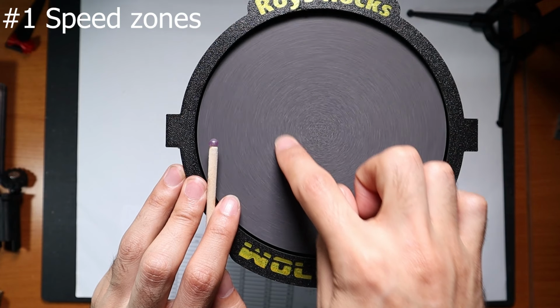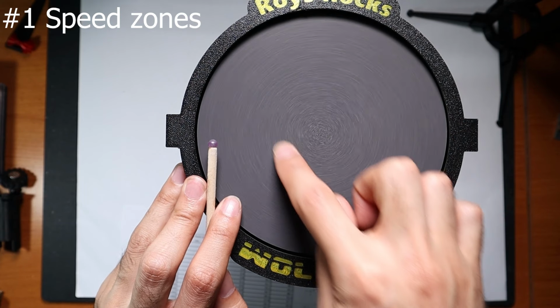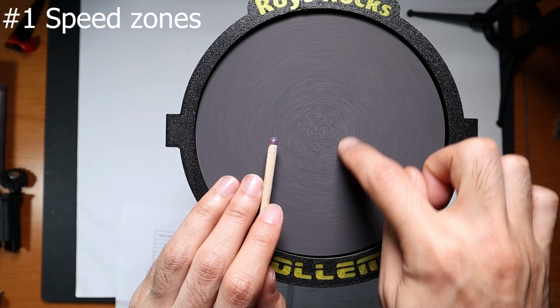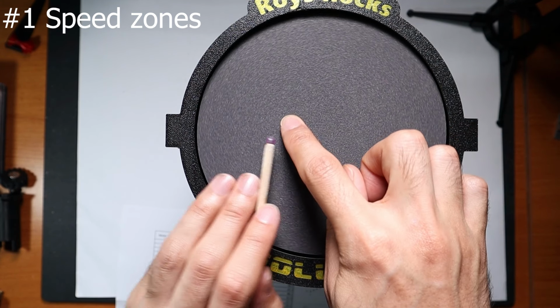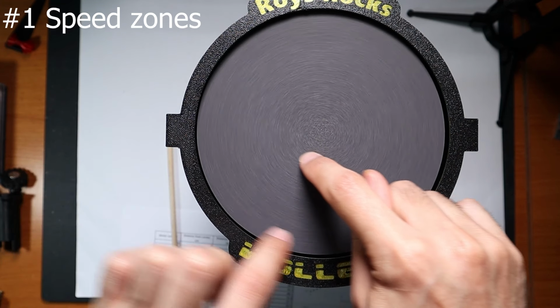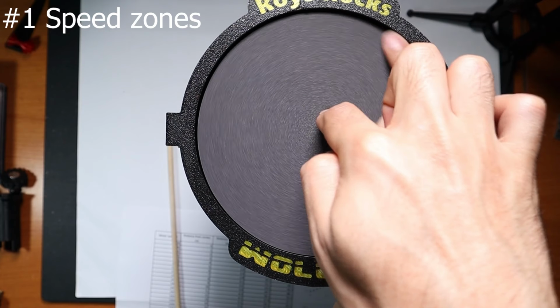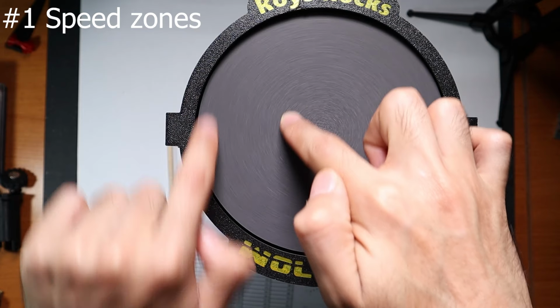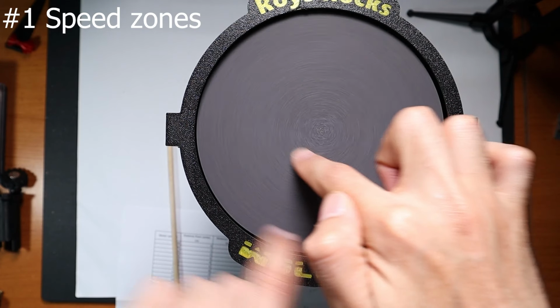So at any moment in time when you're grinding and this thing is spinning at a set RPM, the speed of the surface towards the center is actually going much slower than the speed out here, because while this one travels a full distance around the circle, you can see my other hand is flying way quicker. But these are locked in place.